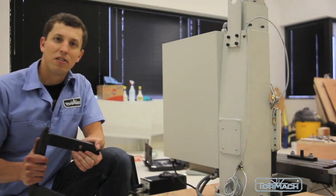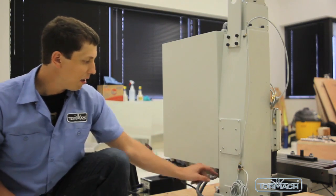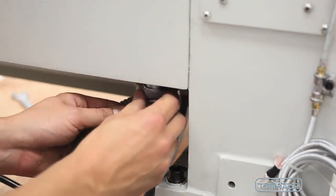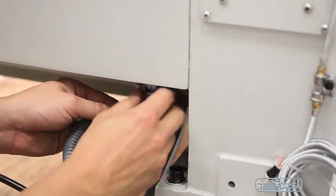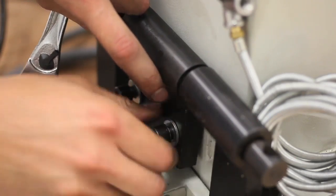All right, so we're almost there. I've got the hinge and I'm just about ready to install it in these tapped holes right here. There are just a couple things that I need to do first: disconnect the oil line from the base to the column and disconnect the electrical connections into the cabinet — specifically the three electrical connections to the stepper motors. These are quick connects so they just unscrew; there's a little jam nut and it comes out. The hinge is designed with a little bit of play in it so you can push it up slightly to get it in the right spot.